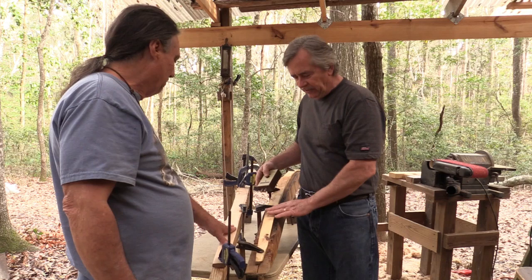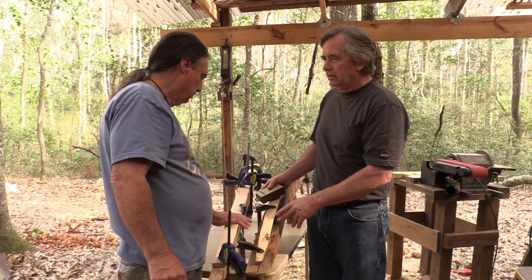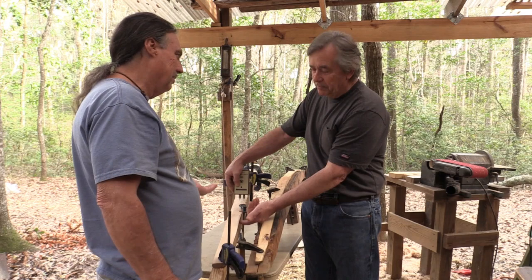I'm not expecting this wood to be 6 all the way through, because the back has been up against this form. But not too long ago, we took it out of the form briefly, and I put the moisture meter to it, and a lot of places on the back were in the 10 to 13 range. But this is pegged out at 25 on the belly. And of course, this back here would be wetter too. Much wetter, yeah.